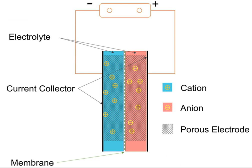This internal DC resistance R_i should not be confused with the internal AC resistance called equivalent series resistance (ESR), normally specified for capacitors. It is measured at 1 kHz. ESR is much smaller than DC resistance. ESR is not relevant for calculating supercapacitor inrush currents or other peak currents. R_i determines several supercapacitor properties. It limits the charge and discharge peak currents as well as charge-discharge times.